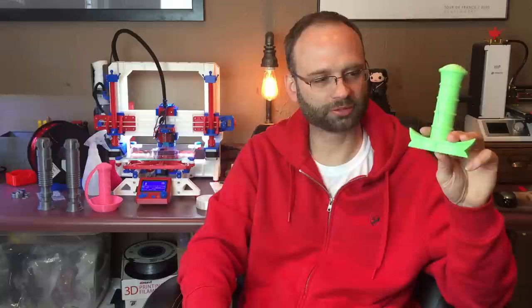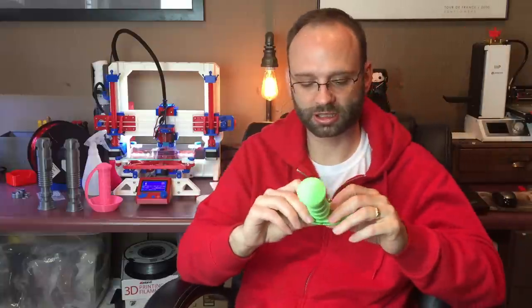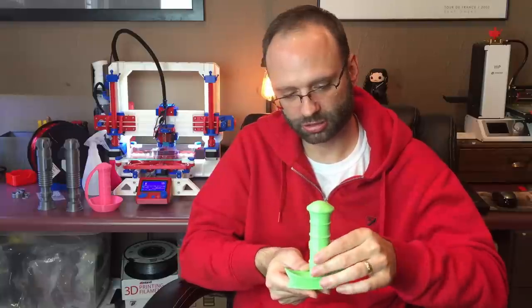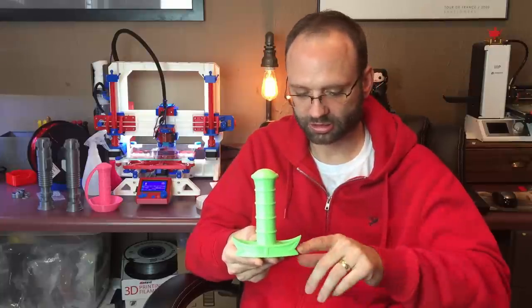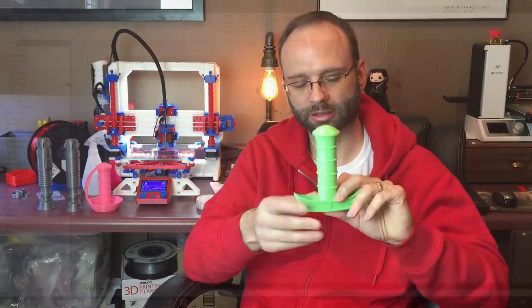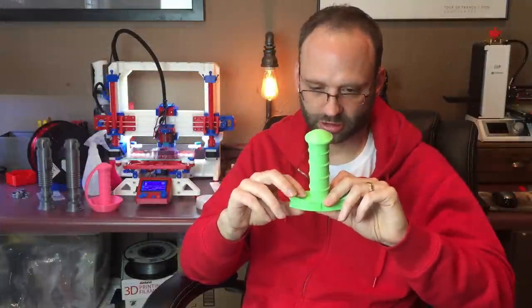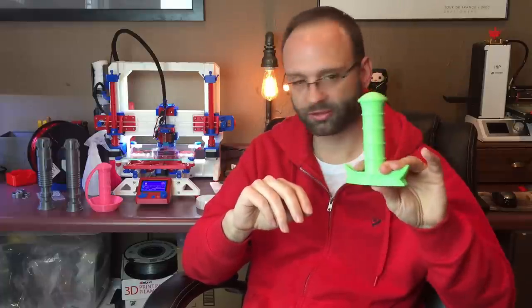So I made the first green one for my son. What's also cool is that since it's printed in place you can basically do whatever you want with the design as long as you don't have any overhangs. You can see this radius starts at 45 degrees — there are no real overhangs on it at all. It does need to bridge at the top, which is just flat on the interior, but that's no problem for most printers if you have decent cooling.